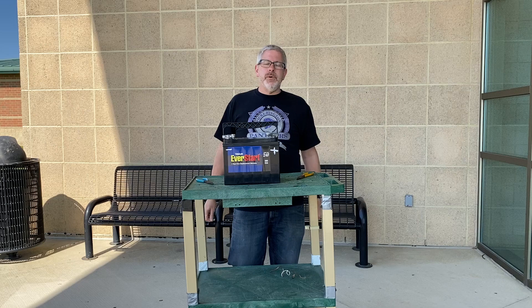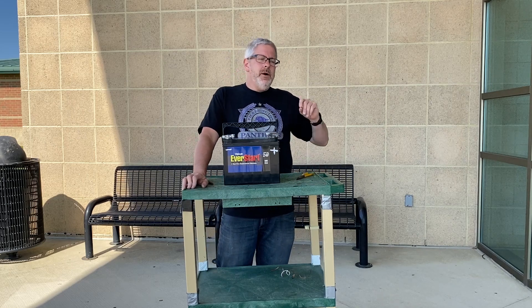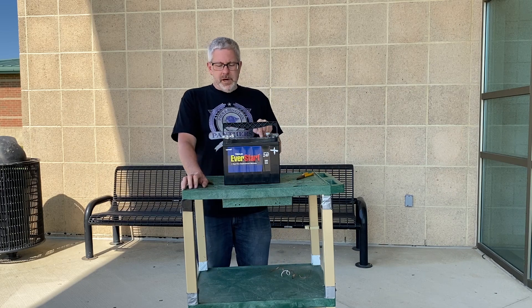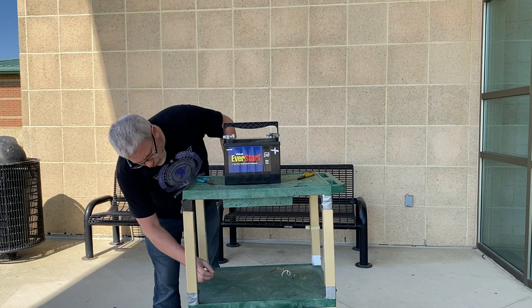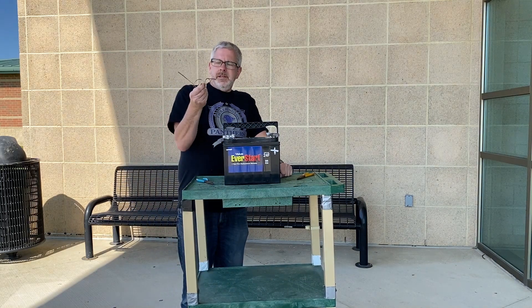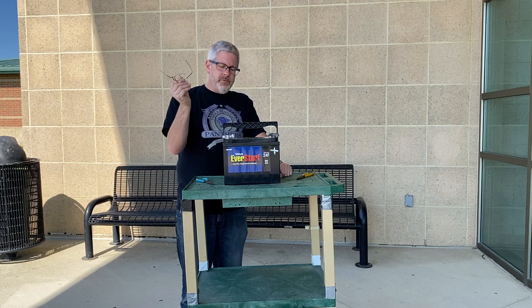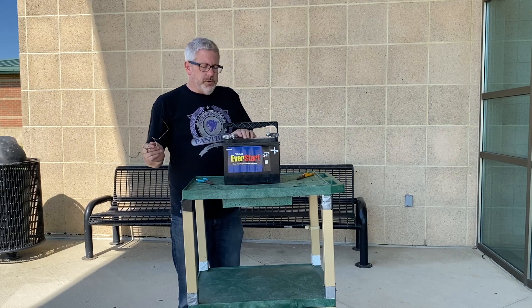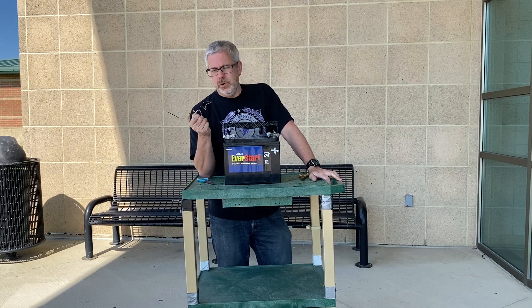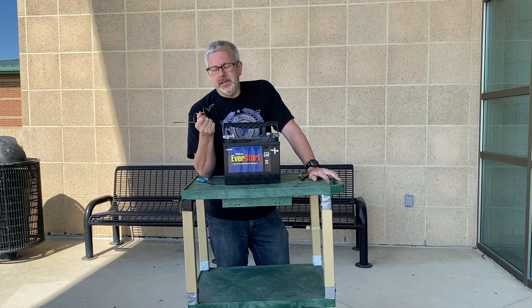I heard something and I'm perfectly safe. The reason behind that is Ohm's Law, which states that current is equal to a potential difference — a voltage difference — divided by resistance. When I think about a copper wire, it's got a very low resistance, less than one ohm, significantly less than one ohm for this short length. 12 volts divided by, say, a tenth of an ohm is 120 amps. That much current going through this wire is going to cause it to create a great amount of heat. In fact, it did — and it melted.